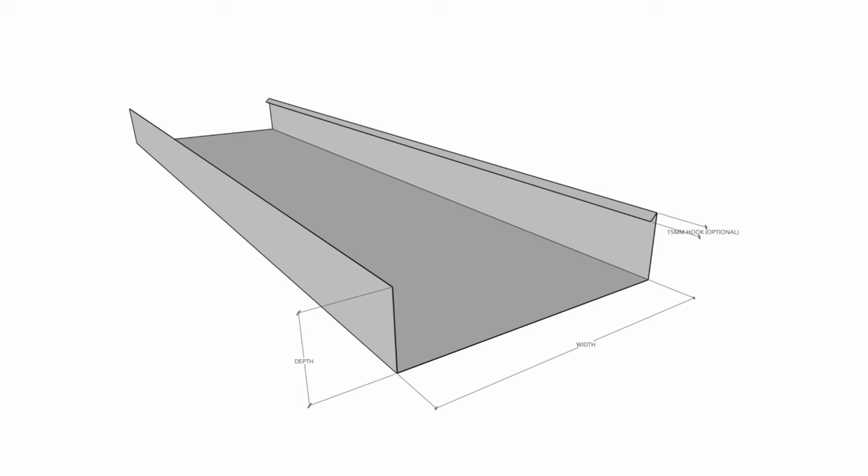But what happens when the water goes down the waste? I was scratching my head about that for a while — how do I capture the water and how do I plumb it so it'll work? My idea was to basically create a box gutter out of colorbond sheet metal. We'd created a heap of custom box gutters at work, and I figured by using the same principles here — this sink is going to see a lot less water than a standard box gutter on a house — if it works there, why wouldn't it work with this vanity?